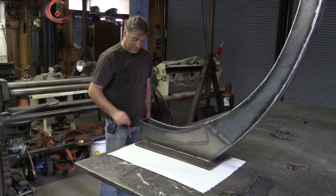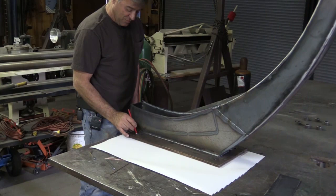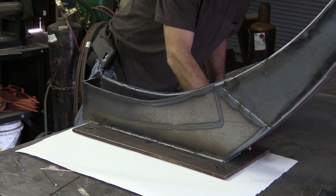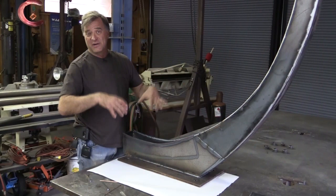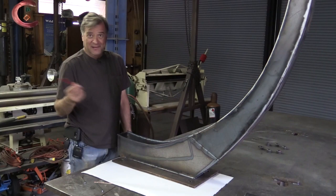I just take my red pencil — I like the red, it shows up nice — and you can just get all the sides marked on there, and be real careful around the inside of the holes so he knows exactly how big those holes are. I believe I drilled these out to three-quarters because we were going to use a half-inch or five-eighths anchor in them, since he's going down in the rock. And don't forget to mark it 'front' — that always helps. That way he knows exactly how to orient it, put it down, mark his holes, drill his holes, put his anchors in, and when this puppy shows up just set it right in place.